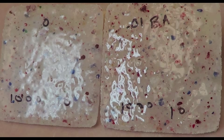On a side-by-side comparison, you can see how much more gloss was retained by the fluxed tile. I plan to do another video on kiln issues, but note that in heating borosilicate, time is your enemy. I have a very fast kiln that will go from 1000 to 1832 in 10 minutes — time your kiln at full blast to see what it can do. All the time spent between 1000 and 1832 degrees de-vitrifies the glass and burns off the flux.